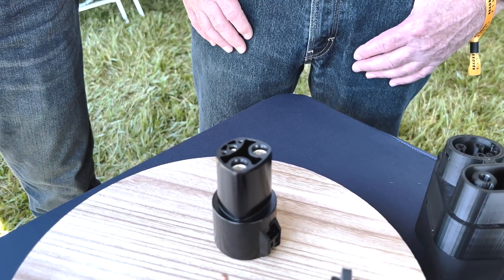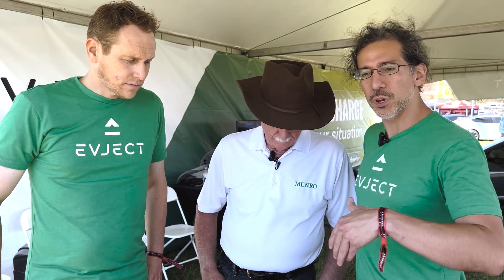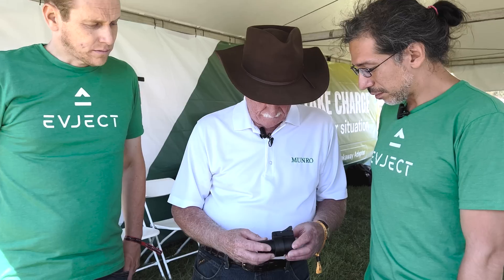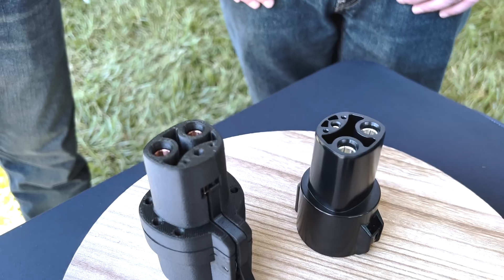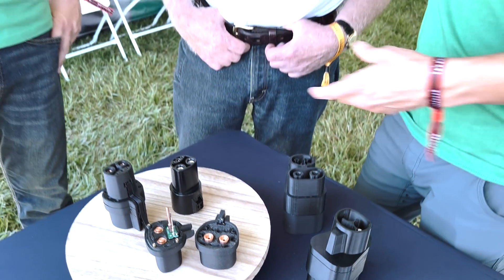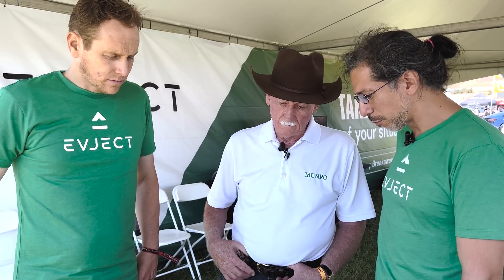When you get your pre-orders, you will be getting a fully injection molded part. These are 3D printed just because we need the reiteration that's necessary in engineering. For low volume, this is actually not a bad way to get the product to market — a lot of people in the aircraft industry are moving away from injection molding and using 3D printing. This is PET with carbon fiber reinforcement, which gives us a similar temperature range to PPS without needing to commission a PPS mold.